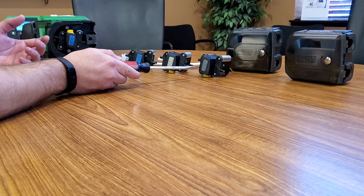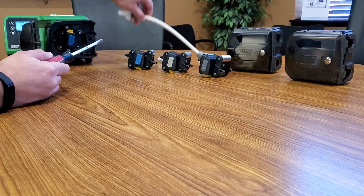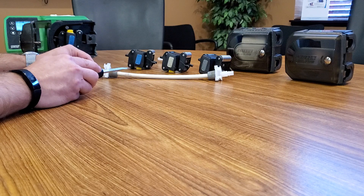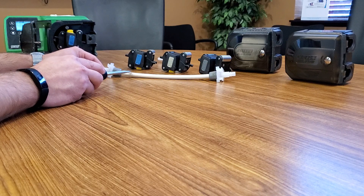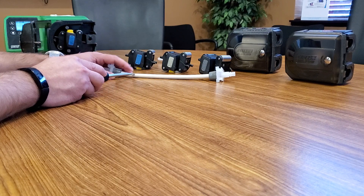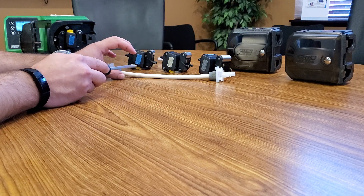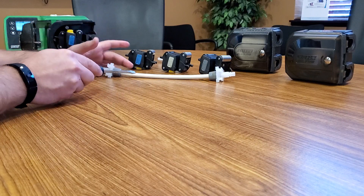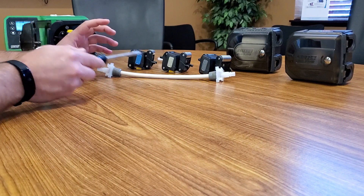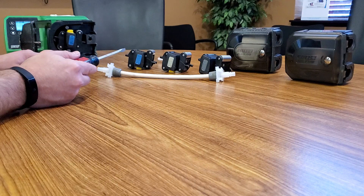The nice flexibility with this pump is we could actually switch out the roller assembly to run a higher pressure. Also, the elements that come with them or that you would order come in different sizes, so we can go up or down in flow rates just by changing the outside diameter of the tubing. The wall thickness stays the same — it's the inside bore that changes. As the roller crushes it, the wall thickness does the sealing; the internal bore moves more or less fluid.